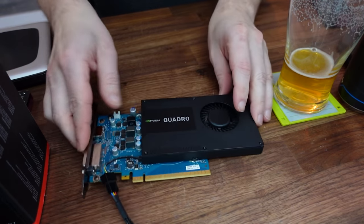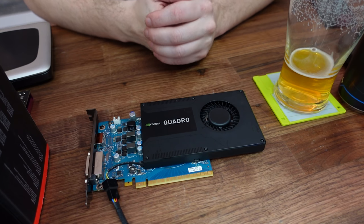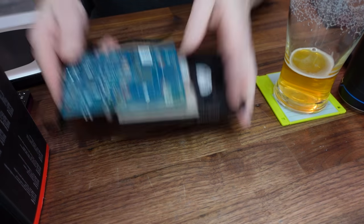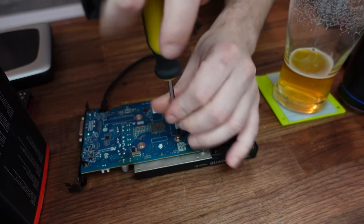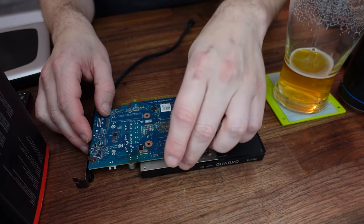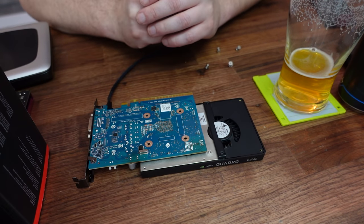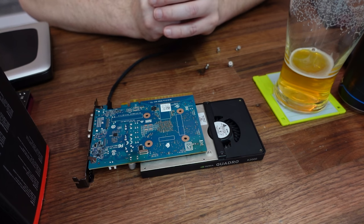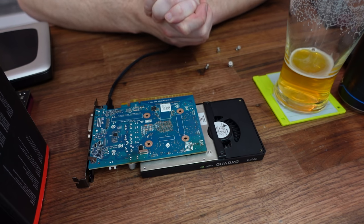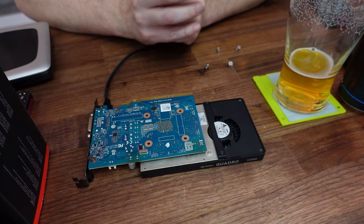So here is the near final result of the GTX 1650. I still haven't taken care of the fan header, but I'll probably do that later on this afternoon. The heatsink is mounted up and fitting perfectly. Now I do have one confession to make since the last video. In the last video, I said I thought this rear capacitor was the problem, as the heatsink was pressing back on it and caused a pretty significant bend. I did check that capacitor after that video and it did indeed break it loose — one of the legs had lifted out of the capacitor and become delaminated from the internal surface. However, that wasn't the problem with the card.